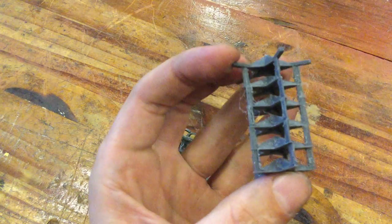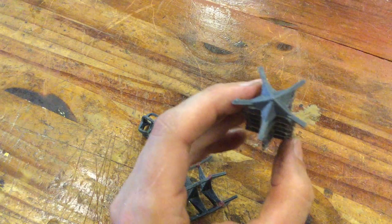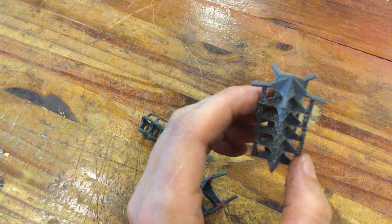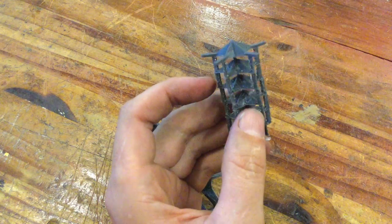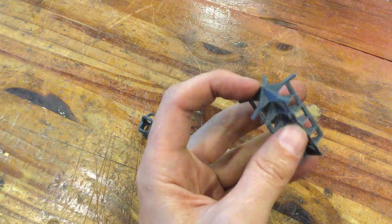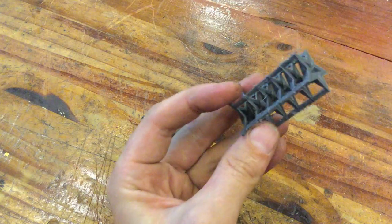The only thing you need to consider when you've 3D printed your parts and done the entire assembly is that the specific weight for doing your metal calculation is different than that of wax. Depending on the infill that you've 3D printed your part at, you're not going to get the same volumetric calculation — if you printed something at 8% infill, it's not going to behave the same as something with 100% infill. So oftentimes you can't get away with weighing your printed part just like you would weigh your wax.